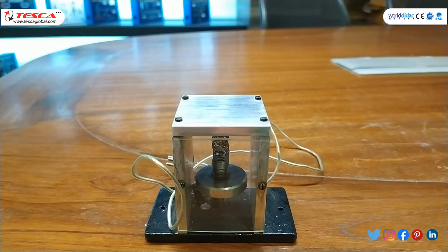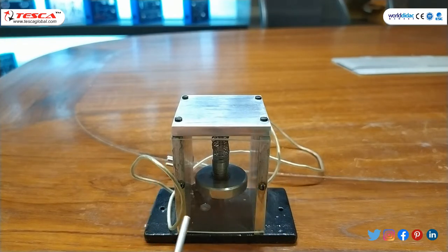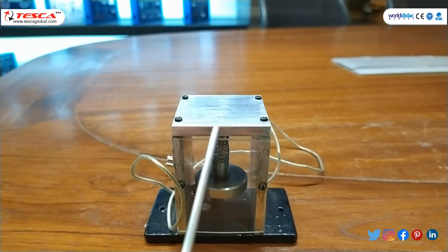The other element is the piezoelectric transducer. The element used in the present setup is a disc-type lead zirconate ceramic crystal, which is multiply stacked — a number of identical plates one above the other — and electrically connected in series. The complete setup is plastic moulded, and one face is epoxy-bonded to an iron plate with two fixing drills.